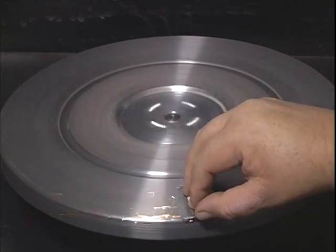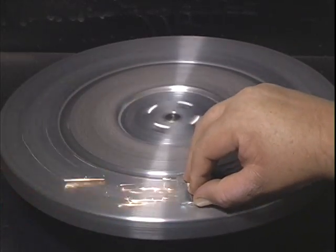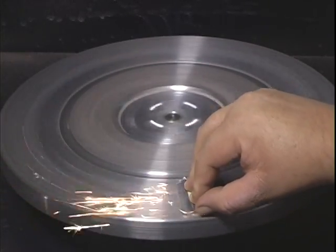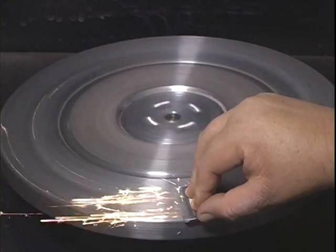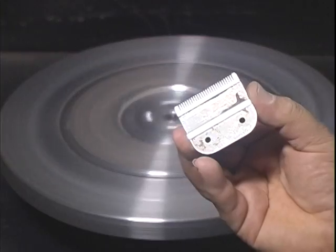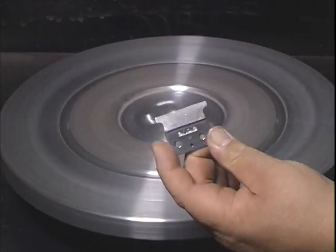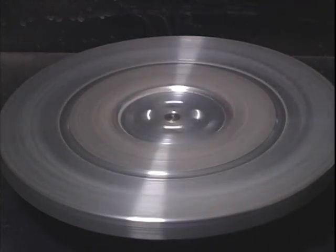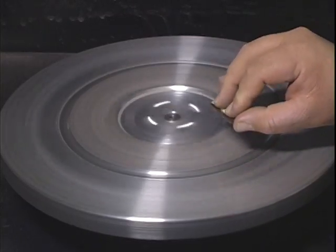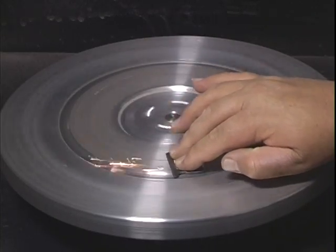Now with the used blade, we'll start making some scratches to season the plate. In a slow motion, you go just like a normal sharpening, left and right, and you will start seeing that the grit starts moving around the plate. But the inside plate, whatever is loose, will throw it to the outer side of the plate and you will have some extra grit.